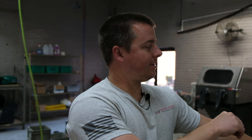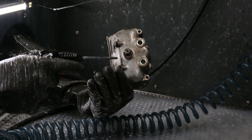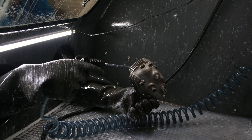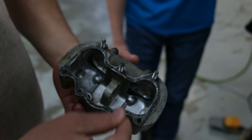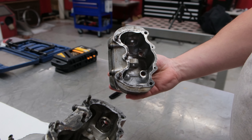What I'm noticing is a lot of people when they use the hydroblast compare it to the vapor hone, meaning they take their time washing and blasting the part. When in reality, this thing has so much pressure, heat, and cleaner that when you wipe across a part it's clean. You can literally just wave the wand over it and it's done. Ryan was being very meticulous, blasting the part as if he were vapor blasting — it's hard to break habits. But the part was dry within the first 20 seconds he hit it with air — the water just evaporated away. This thing is clean. There's no oil, no grease — it's ready to be put in the vapor hone.